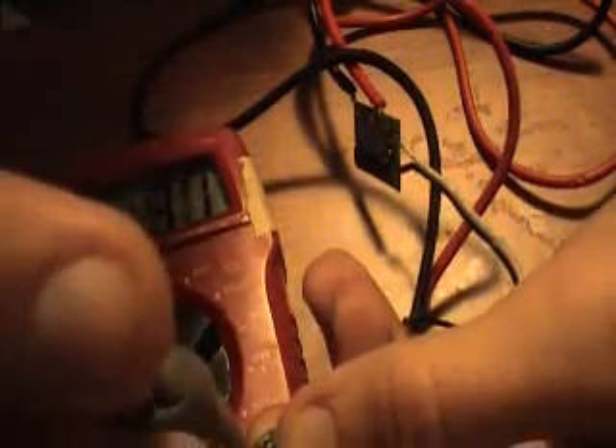Now you need to find a tool small enough to go into this pot — that's kind of the trickiest part. It's one of those micro-screwdrivers. There's a big thing of epoxy on it. Hit it until it catches. As you spin the pot the numbers start to go up. It'll reach its highest and then drop back down to its lowest — there is no end, it's a 360-degree pot. I'm aiming for around 320. You'll also find it won't be consistent; as you turn it, it'll go up slowly and then have one little spot where it just jumps up really quickly — very sensitive.